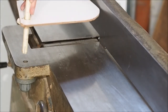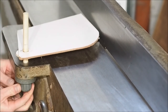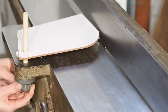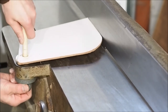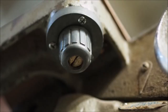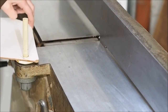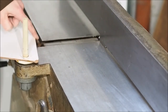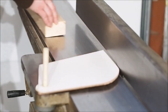Once the glue is dry it's time for a final fitting. Slide in the dowel, grab the knob and turn it counterclockwise, apply some good tension, then push the dowel all the way in. Make sure it fits snugly — each side of the dowel should be on either side of that pin, which is what helps it snap back into place when twisted outward. Based on my test it looks like it works, but let's try a final pass with a piece of wood just to be sure. And there you have it.